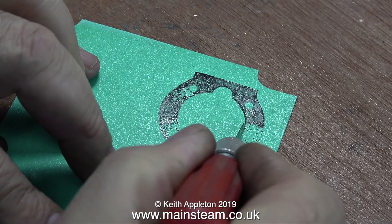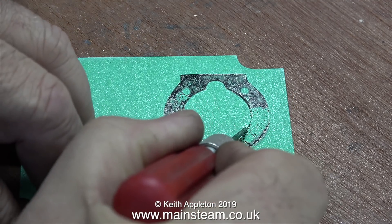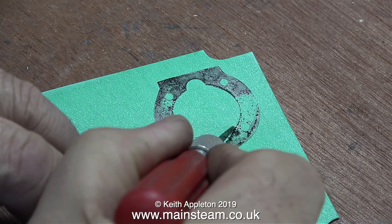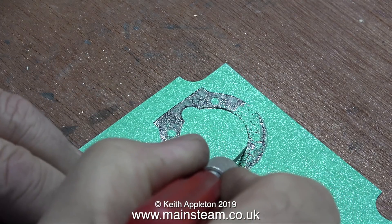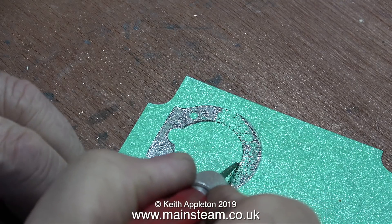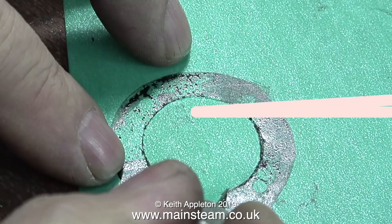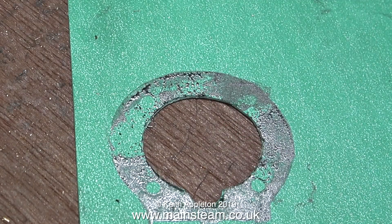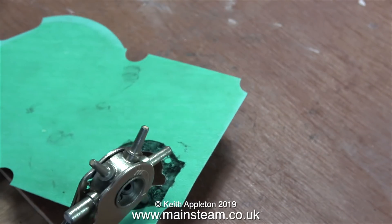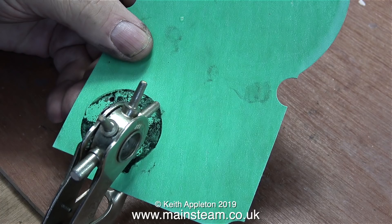The first thing to do is to cut out the centre. I find it's best to do it this way because if I cut out the gasket on the outside first, I'll end up with a very small part that may rip as I'm cutting it. Whereas when it's all fully together on the sheet, it's quite stable and I can put a lot of pressure on to cut out the centre. Don't cut yourself when you do this — and this is another reason for leaving the part intact on a sheet, because you can keep your hand well away from the knife blade.